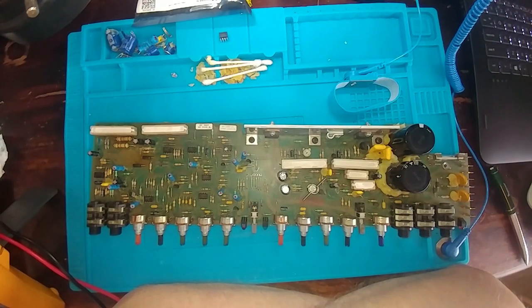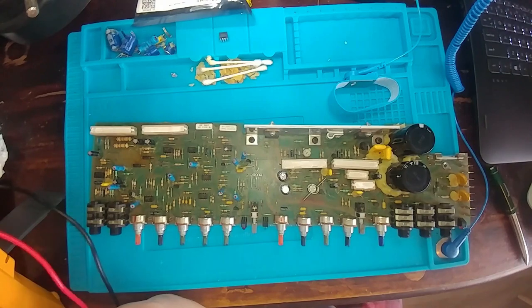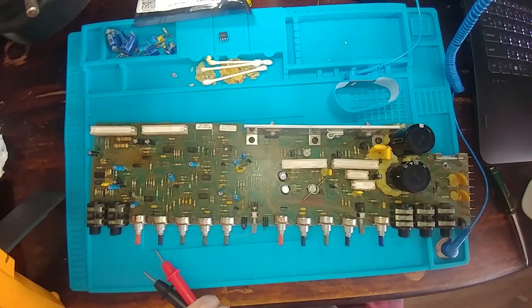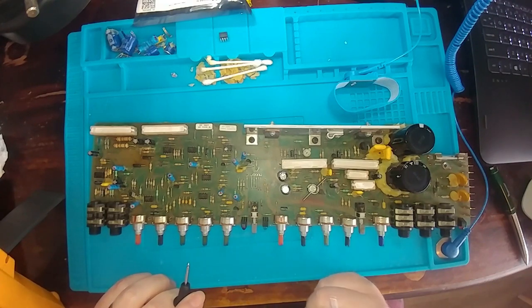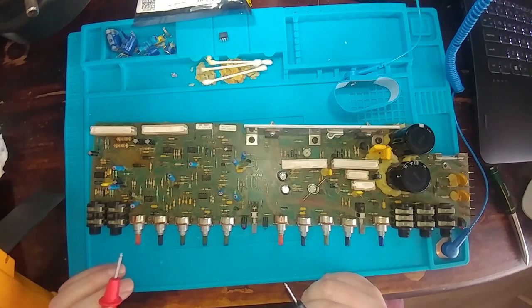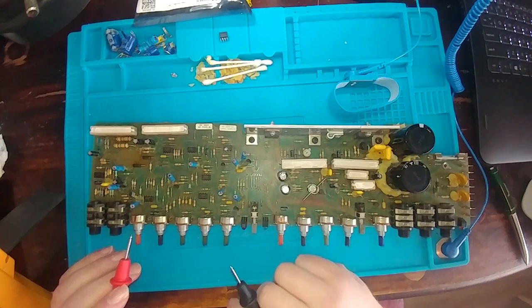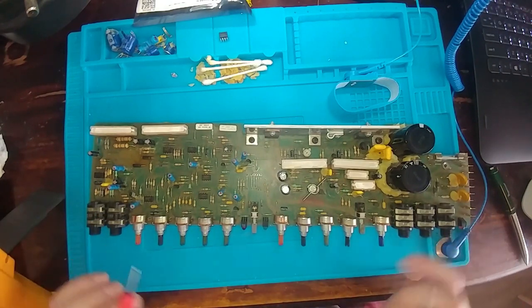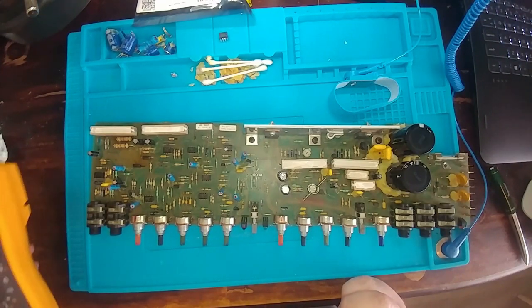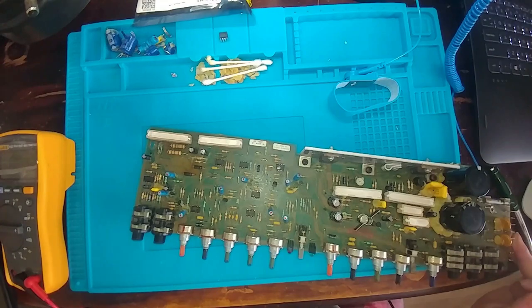So how do we tackle this? We'll tackle it with the op amps first. It's just a simple check that you can do on these dual channel operational amplifiers. Now this is by no means the best test. The best test would be to pop them into a breadboard and look at them on an O-scope and see how they can either invert, or look at the non-inverted and then invert the signal and take a look at that as well. But something we can do, and I'll just show you on one. Let me bring this over. We'll zoom in a bit.